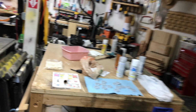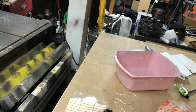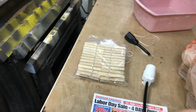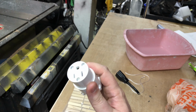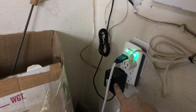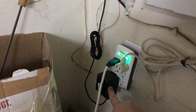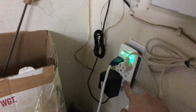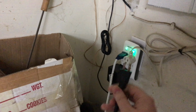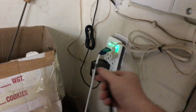But whenever you do that, you end up cutting the ends off of cords. So I have a ton of extra cord ends just lying around. And a nice utility thing that you can do with those is just slap a plug on the other end. You're going to purposely make a super short extension cord. The reason for that is often, like over here, you're going to find cases where you have a power brick, these big wall warts, right? And they inevitably end up covering up two different spots. So if you don't want that to happen, you plug in one of these, then you plug your wall wart in here. That way it's freeing up all of your various spots.